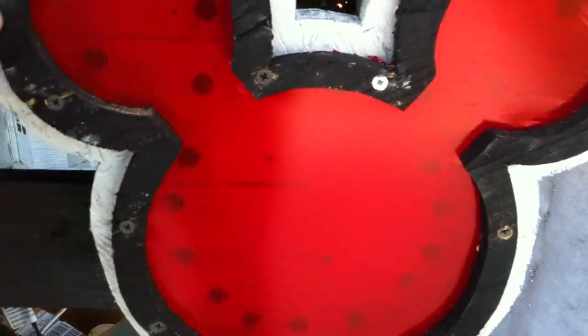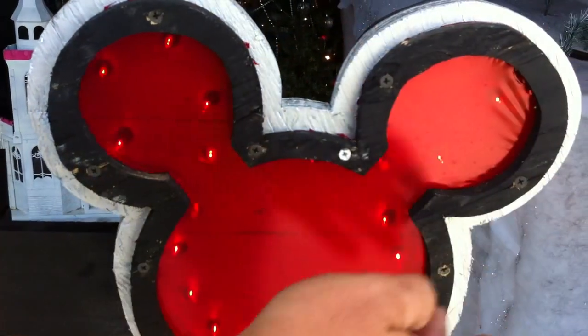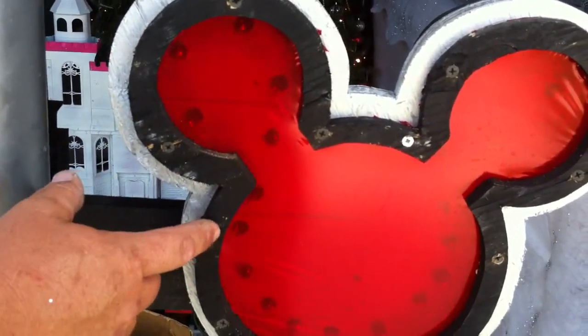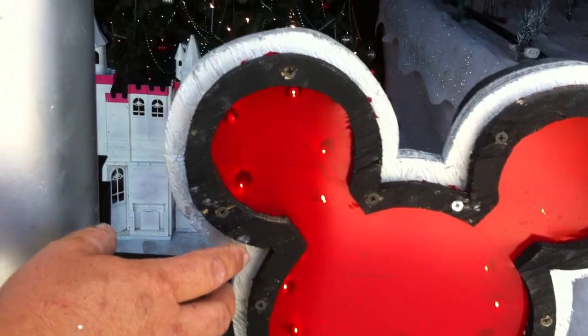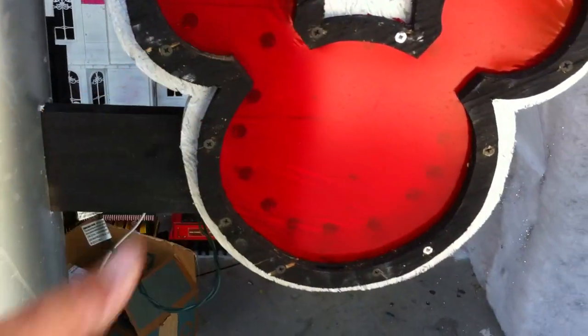Below this line is stapled in place. The key here is getting it over and stapling it where you're going to cover with the faceplate. Once you're done, mount the faceplate, then heat it. Mount the faceplate first, otherwise it will pull out and it will not work. Once you're done with that, go back with a razor knife, cut off the extra, and you're good to go.